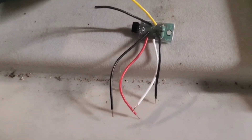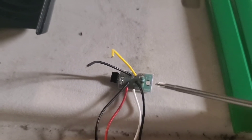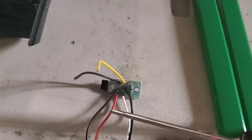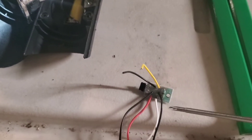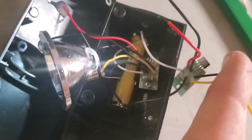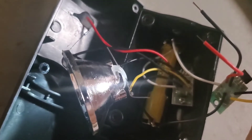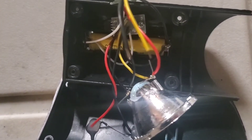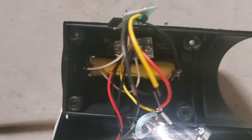Once you've stripped your wires, make sure you've identified which wires go to what. On this board, the two right here originally went to the battery. The two on this side went to the solar panel. And these two went to the light. The first two that we're going to be soldering back into the light are the two off of the battery, and we're going to solder them back to the battery leads. Once the battery wires have been secured, take the ones that had come off the solar panel and solder them to the light. At this point, the only two wires remaining should be the two that had been going to the light off of the new board. Feed these through the slots at the back and bottom of the unit. Return the light and its lens to place, and close the clamshell back up.